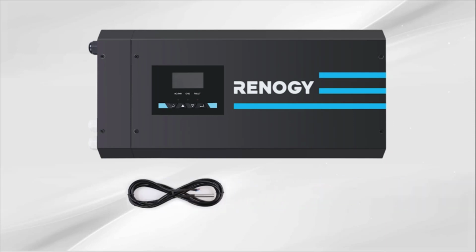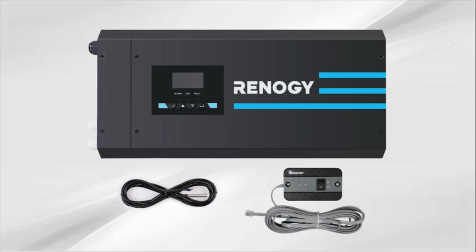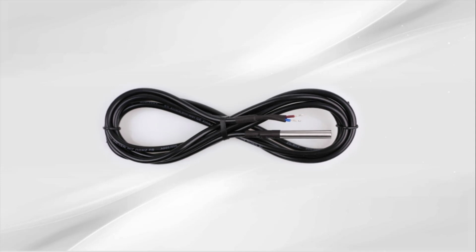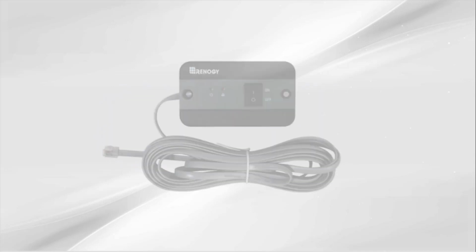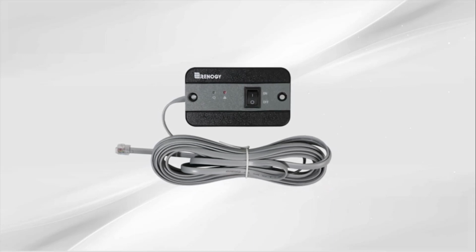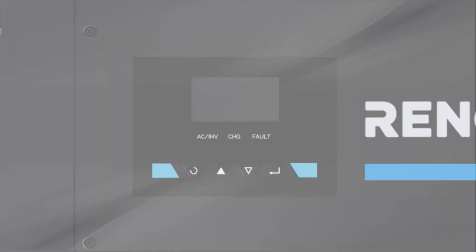The inverter charger is shipped with a battery temperature sensor and a wired remote control. The sensor allows the inverter charger to continuously adjust the charging voltage based on the battery temperature. The remote control allows you to turn on and off the inverter charger from a more desirable location. It features smart LED indicators and an LCD display to view the inverter's status and programming features. There are 4 buttons to navigate through each screen and for programming.